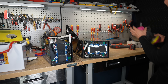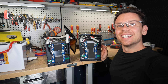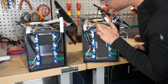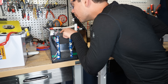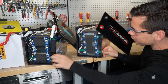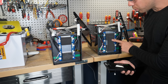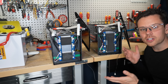It's the same battery — it's literally the same. These are exactly the same. Almost everything: even the zip tie placement is the same. There is literally no difference. Even the number on the BMS is identical, and the cells state 1,004 watt-hours. Let's see if the cells are the same. This one says 1,004.8, but these are different — this is 976 watt-hour cells. But the marketing says 300 amp-hours on both of them. Divided by 3.2, these are 314 amp-hour cells, which is why they pulled so high, and these are 305 amp-hour cells.